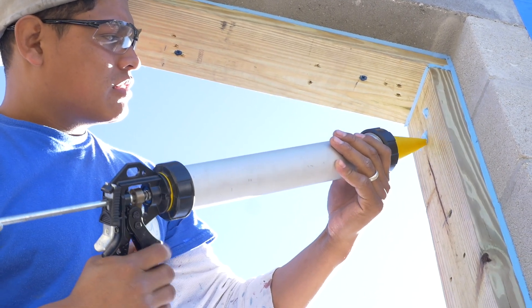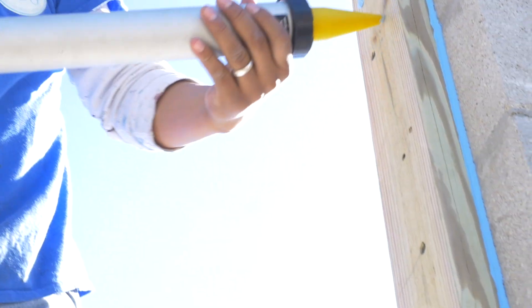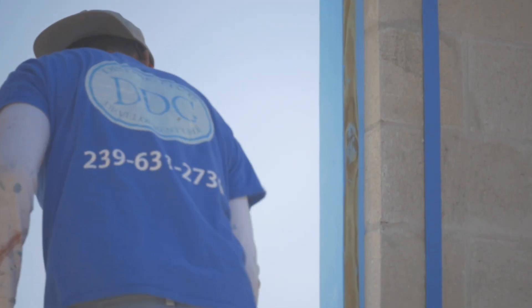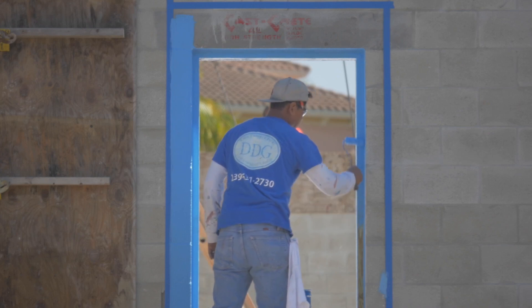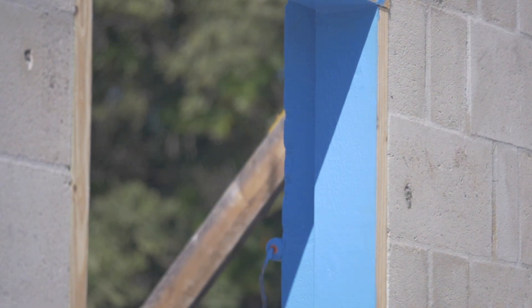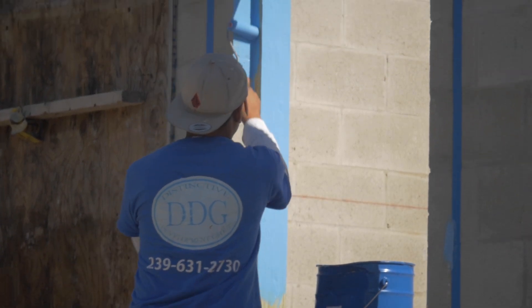After we detail the joints from the concrete to the lumber and over the screw heads, we go over it with the flashing membrane — that's our 2400 roller grade that they're using behind us. One of the things I find most appealing about this fluid-applied system is that you lose some of the origami and hard install, especially when you think about these windows, which happen to be a recessed window buck. With traditional methods you'd have flashing, tapes, layering — what goes first, what's lower, what's higher. It's pretty incredible to see when it's all done.